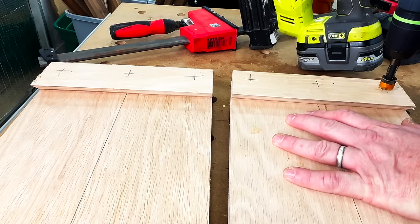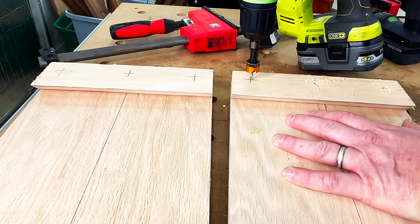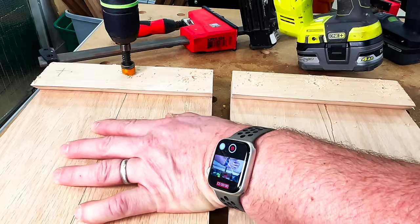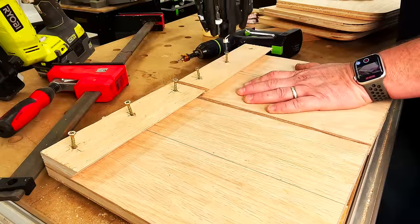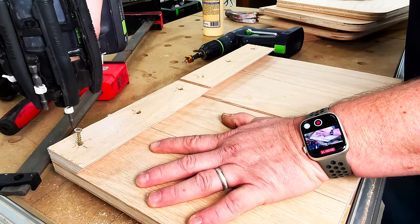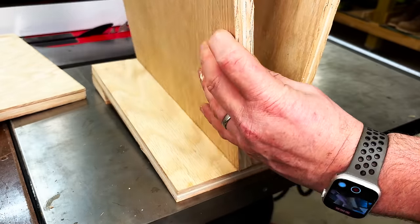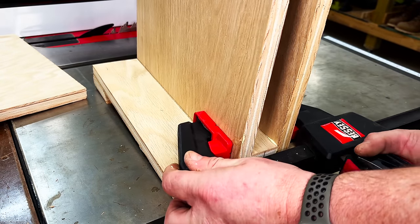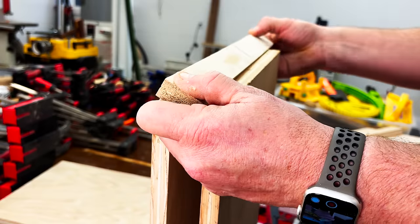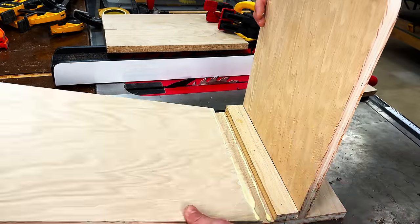To add a little bit more strength I'm going to pre-drill and countersink three screws into the back of each cleat, then send the screws home making sure none of the screw heads protrude off the back. With the cleat attached and the inch-and-a-half spacer attached, I can now add my two support beams with just a little bit of wood glue and some clamps. To make sure both support beams don't bow inward during the glue-up, I'm placing an inch-and-a-half strip at the very end for support as the glue cures. I'll repeat this process with the second clamp rack.